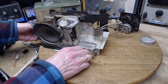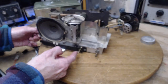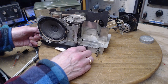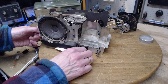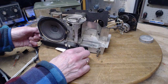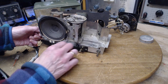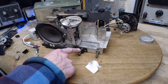Does it feel any better? Hard to say. Now, when you put the knob on here, you get a lot more leverage than what I'm doing. So by doing this, I'm sort of making myself more sensitive. Now I could feel that I was turning this and this thing wasn't moving. The string is slipping. What was that sound? These things tend to slip in one direction only. The other way they tend to work better. And that's because of the way the string is looped around right in here.